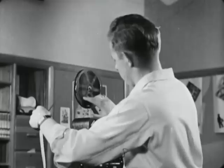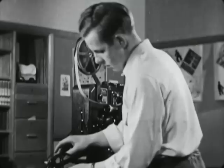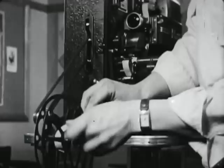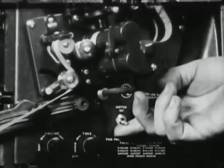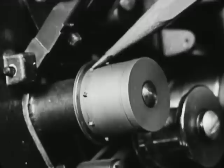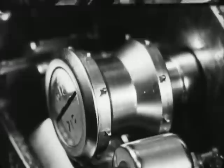When this has been done, the first film on the program should be threaded in the projector. After threading, the motor is turned on, then the lamp. The image is focused and brought into proper frame. Remember that on sound projectors, the sprocket wheels have sprockets only on one side, because sound films have sprocket holes only on one side — the sound runs down the other.